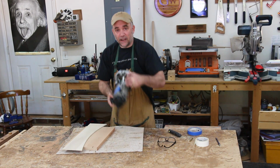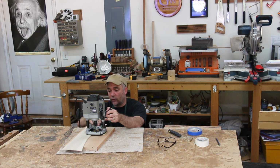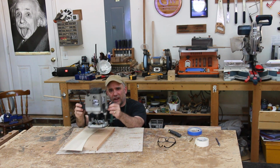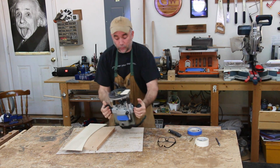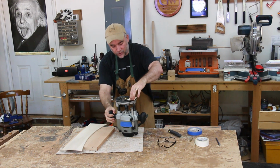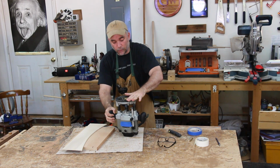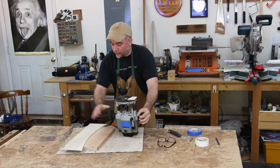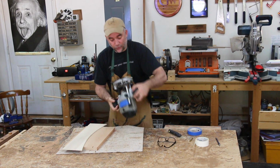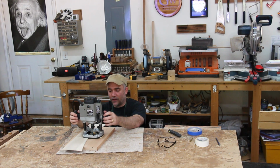Now, because the base of the plunge router is only going to be supported by one side of the base on the template, there is a tendency for the router to want to tip if you're not careful. Now, to completely prevent this from happening, I secured a piece of 1/4 inch thick plywood to the left side of the plunge router base with some carpet tape, and this plywood is also the same thickness as the template. Now, this will prevent the router from tipping as I'm routing out my channel, so it makes it nice and secure.